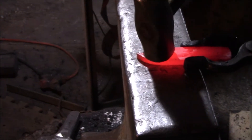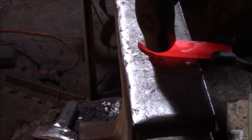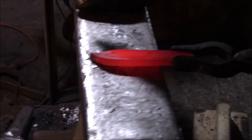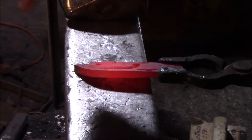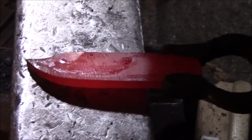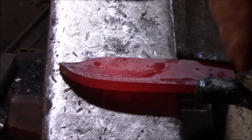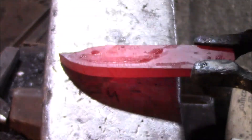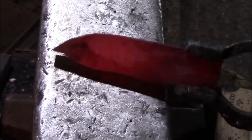So why did you cut it off the other way and work your way around? That way the pattern — if it comes along that edge and I just use that other point, the pattern will be distorted. So if you can see the lines in the billet now, when I bring that around, that whole pattern will flow out with the blade edge the whole way up, and then I'm not cutting it off when it comes time to grind it.